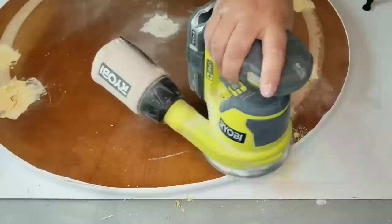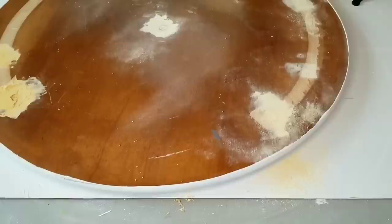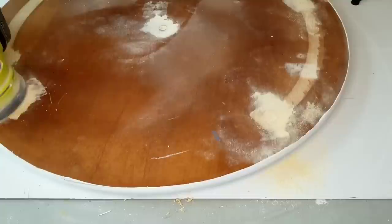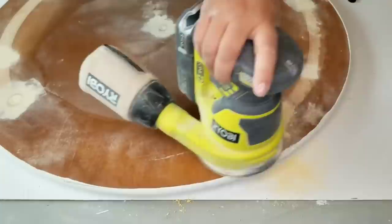All right, so now that everything is dry on the opposite side as well as the wood filler, I am going to sand the excess wood filler out using a 120 grit sandpaper, and I'm just sanding it until it's nicely smooth. And then I am going to dust it, remove all the dust, and give it 2 coats of the same paint, Rust-Oleum chalk paint in the linen white.